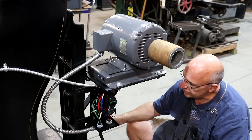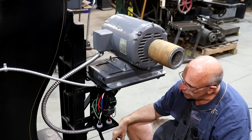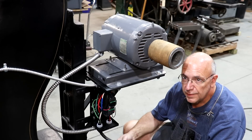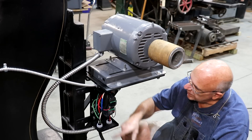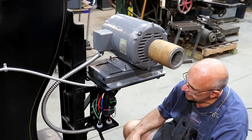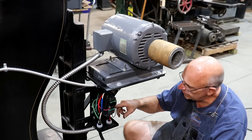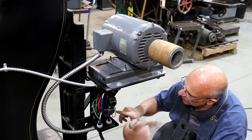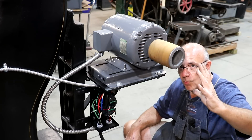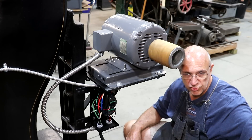I think we have this thing wired up — I saved you guys the boredom of watching me wire this stuff up. Electrical work is just slow and tedious, it takes time. But real briefly, let me just tell you what I got. Power comes in — I got a cord going out, this is a 30-amp circuit coming in. It feeds into the top of the motor starter up here, my three-phase lines coming in. Comes through the motor starter, goes through the overload protection down here, which gives us the protection if the motor draws too many amps. I've got this thing set on 22 amps right now, which is what my motor is rated for. So if we draw more than 22 amps, it will trip out right here and protect the motor, even though we're feeding it with 30 amps total.